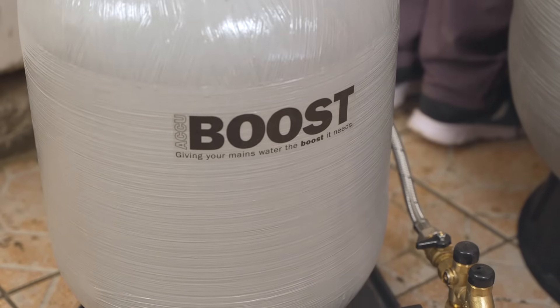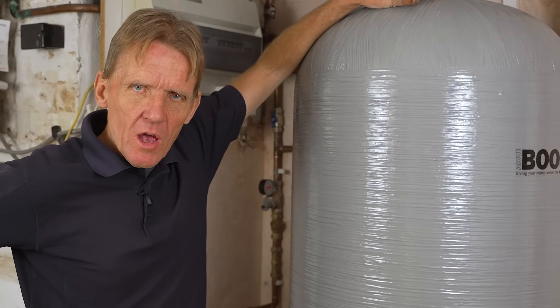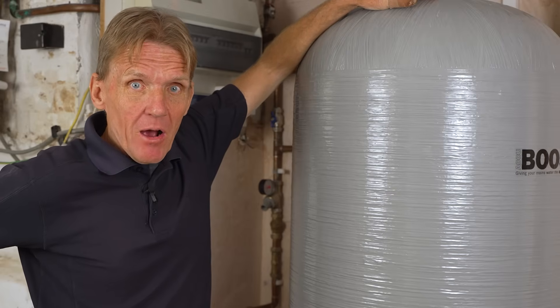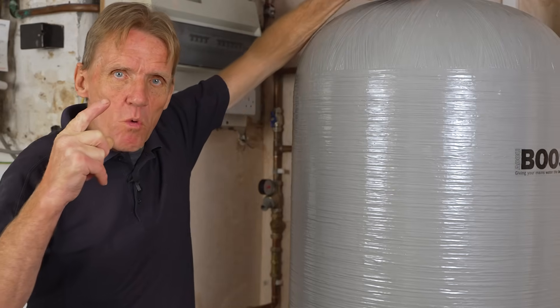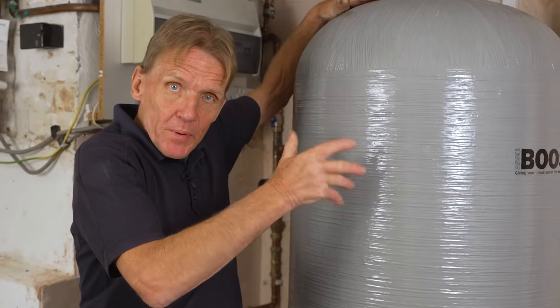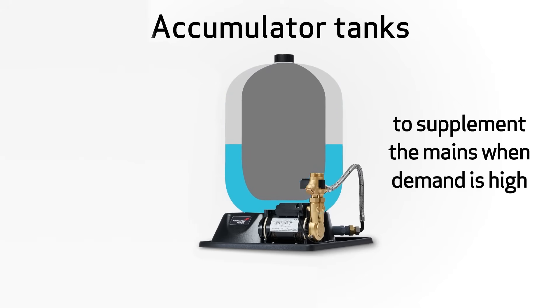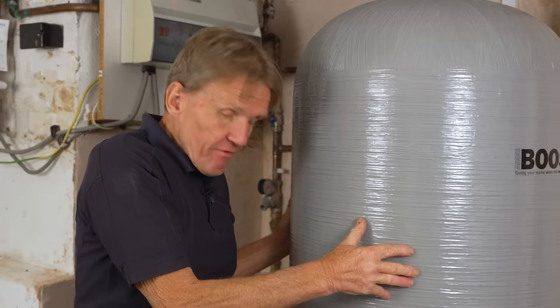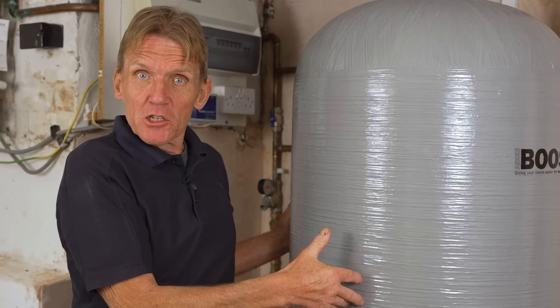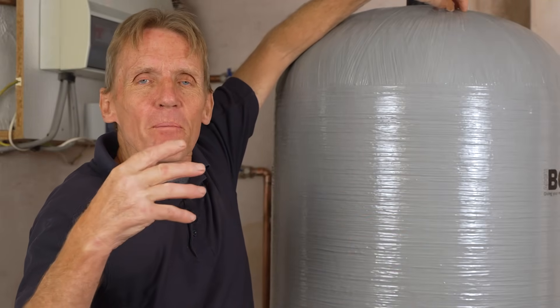I want to show you what we can achieve with the pumped unit. I was thinking about how you drain the unit because it's in the cellar below the drain, and I thought I'd have to pump it out. But then I realized that the bladder inside, if you turn the unit off and start draining it by opening a tap, the bladder — because it's full of compressed air — will squeeze the water out of the AcuBoost. It should end up virtually empty, maybe just a dribble in the bottom. In this case I don't really need a drain cock; I could just disconnect the flexible hose for that last bit. Before I remove the unpumped AcuBoost, let me recap on what I said earlier.